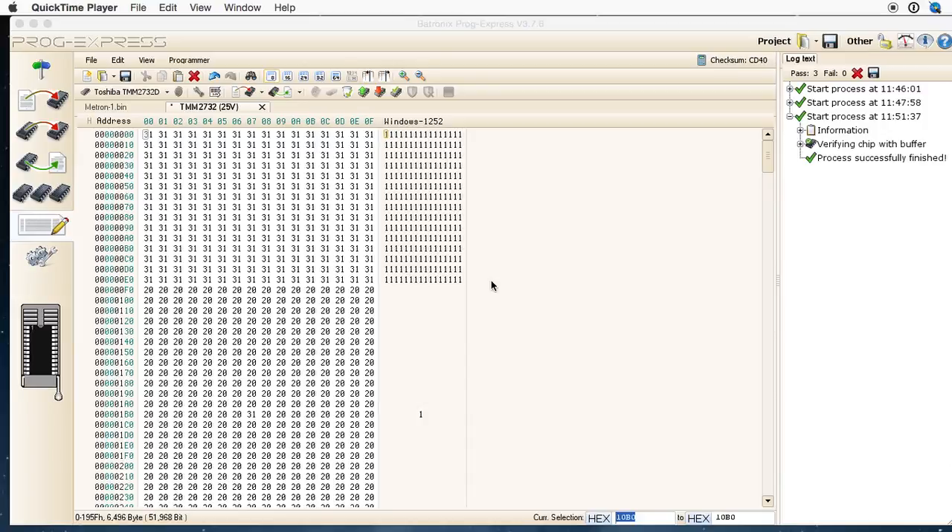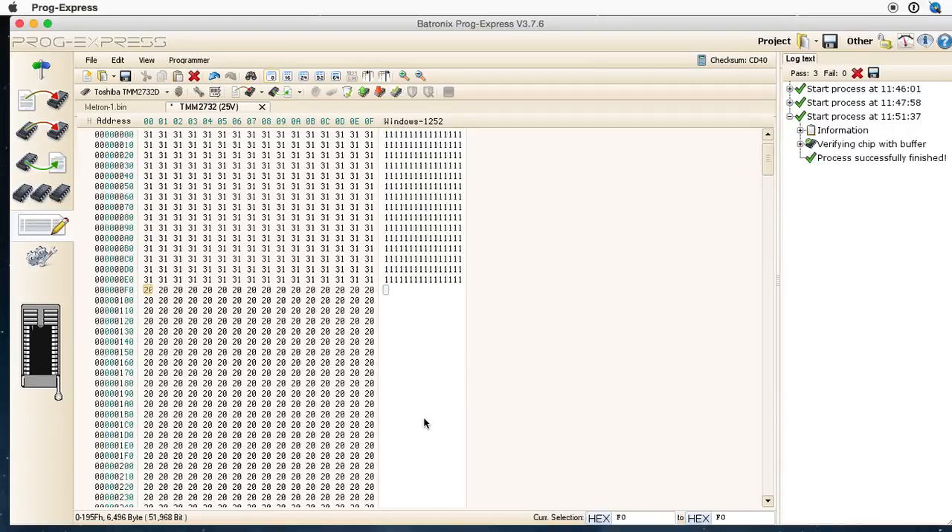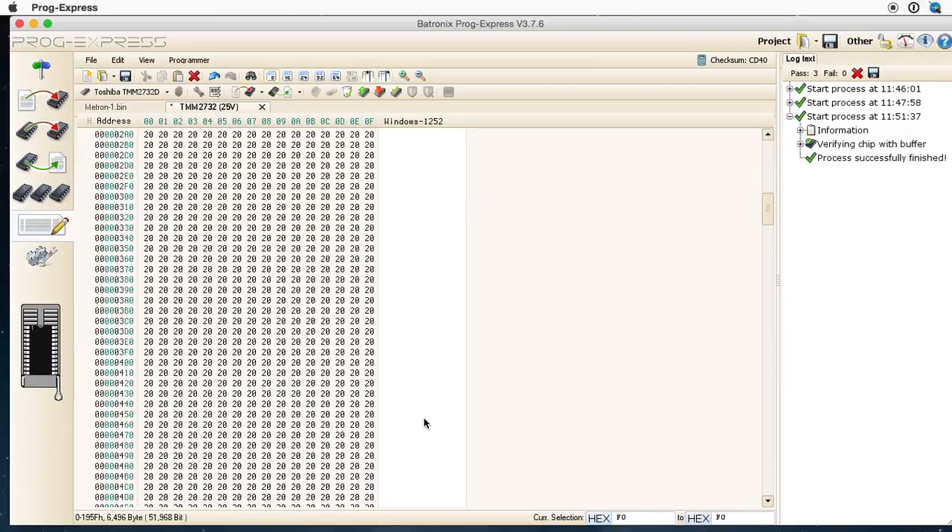My understanding is that if you expose an EEPROM to UV light, it will lose data, just like when you stick it in a UV eraser for five minutes. So I'm going to prove this, hopefully. I've done some test code here. I started out with ones and then I've just gone with spaces in the end. This is a full chip's data — it actually overflows because I've got too much data in there.